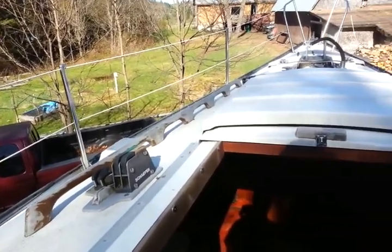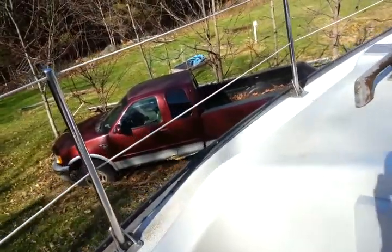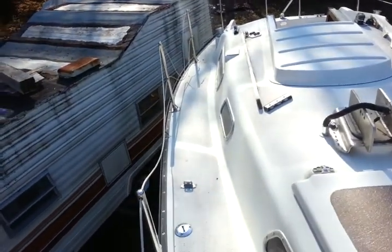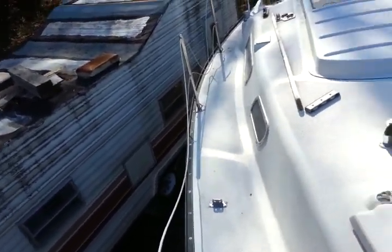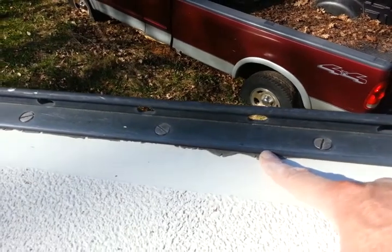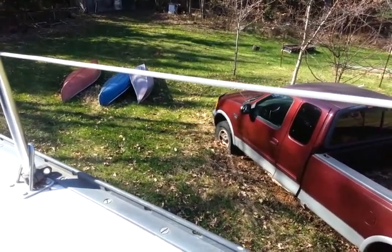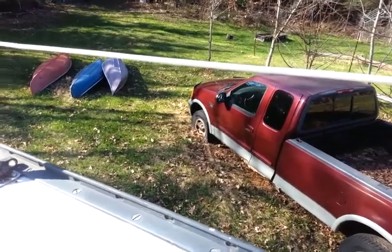The railings and the wood stuff are going to get done first because it's been neglected too long. Other little things I want to do — go around the windows again with caulking, get some marine silicone. Maybe take the windows right out, clean them up, put in new gaskets. There's marine silicone — almost all the older sailors tell me don't use silicone, get the right stuff. The right stuff is kind of a rubber sealant in a silicone form and it really does do the job well. I'm not going to take off the deck rail because that would be a recipe for disaster — each one of these screws is fiberglassed on the bottom on the inside of the boat, so you'd be getting into major work, and I would not want to see the deck split.